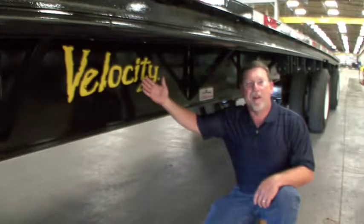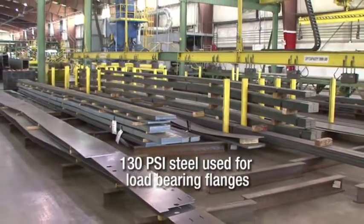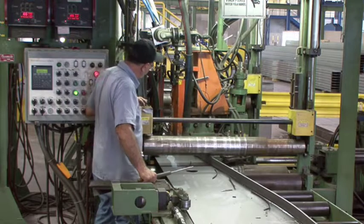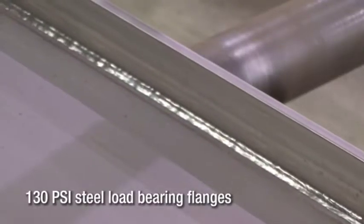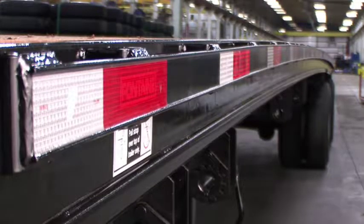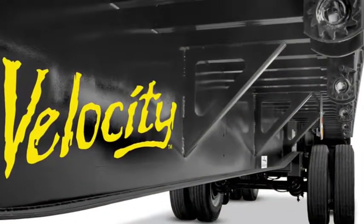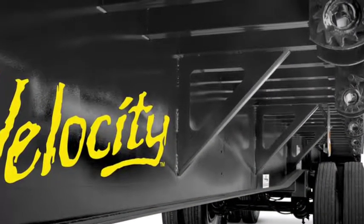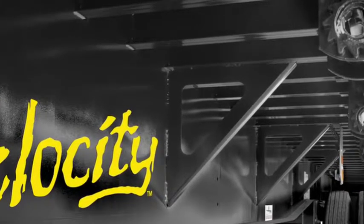The strength and backbone of all Fontaine trailers begins here with the extreme beam. The fabricated steel extreme beams used in the Velocity trailer are constructed using top and bottom flanges which are joined to a single one-piece web by continuous full-length welds on both sides, making it a true I-beam. These fabricated main beams are made with positive camber in order to accommodate expected loads. The Velocity features one-piece fabricated steel side rail braces and supports spaced approximately 60 inches apart. These serve dual purposes: to strengthen the main beam web as well as providing heavy duty support for the outer side rails and deck.